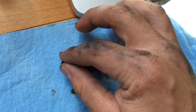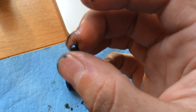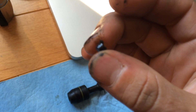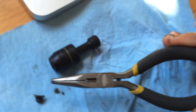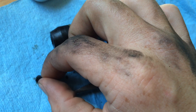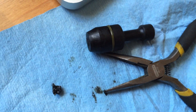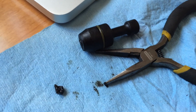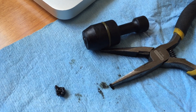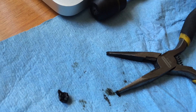Here's an important warning: the timing pin has a little plastic piece on the end. When you rotate it and it engages and you keep turning, that little plastic nipple will break off and stay inside the cam track — which is exactly what happened to us. Luckily, I used small needle nose pliers to grab just the end that was sticking out of the camshaft and could pull it out without dropping it. Instead of pushing the pin in, you can just stick a phone camera in there to visually line it up, so you don't even have to use the pin.